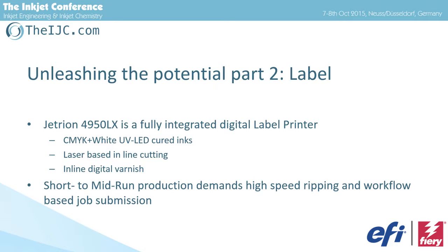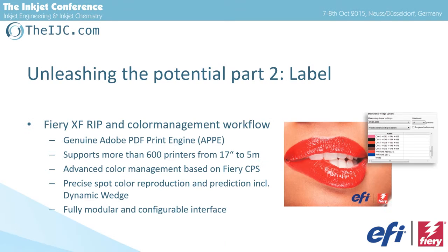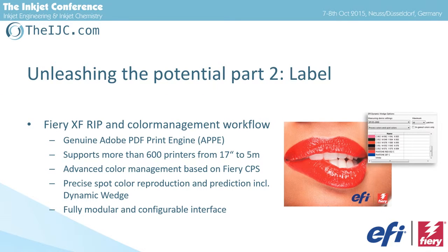Another thing in industrial printing is small web label presses, like the EFI Jetrion. It's a 44-meter-per-minute printer — CMYK plus white — with laser-based inline cutting, so no need for die cuts. It has inline varnish and is designed for short and mid-run production. However, this particular machine is not fully equipped — there is no white and no varnishing in it. Fully equipped it's even wider. Here again we had to adapt the RIP to this product, because all we knew from a standard RIP is that it's based on an Adobe PDF print engine supporting more than 600 printers, but it's not dedicated for the label industry.